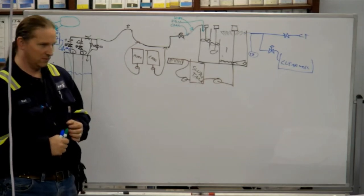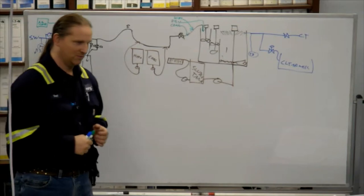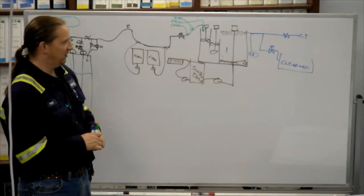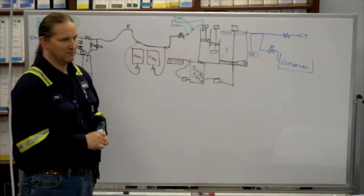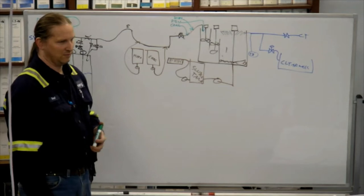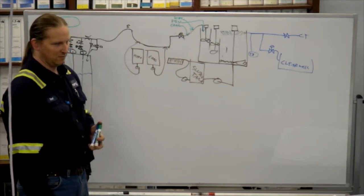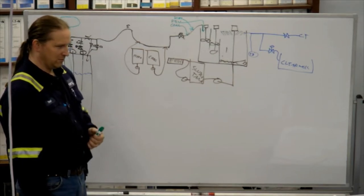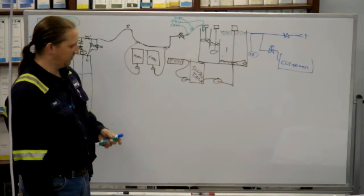Alpha's dedicated just to the cooling tower because we pump the chemical into the Alpha and clear well. That is correct. If you tried to run that into your demin, you'd just plug all the filter stuff out there. It worked, but you'd be constantly cleaning. You wouldn't get near as long on the multimedia filters.